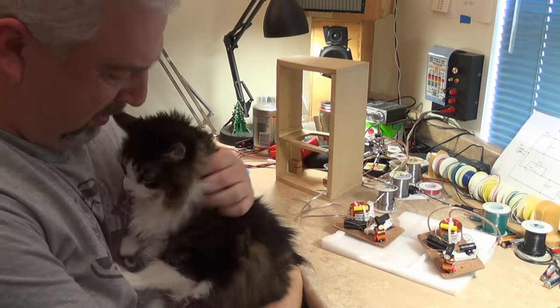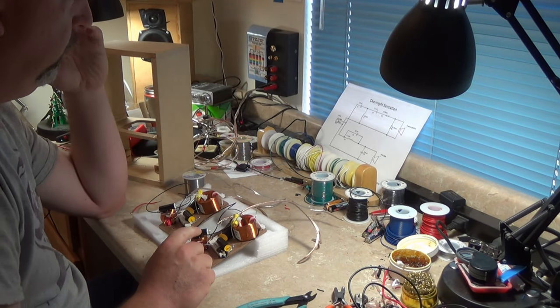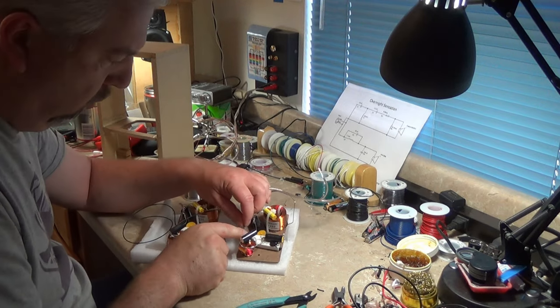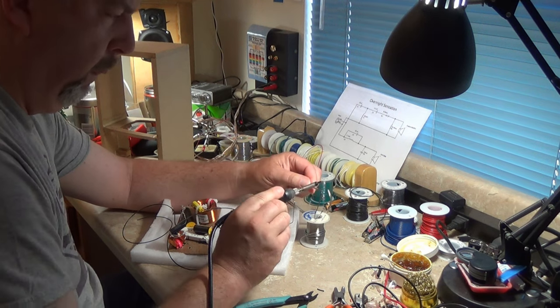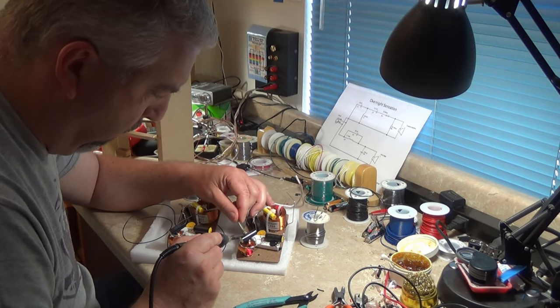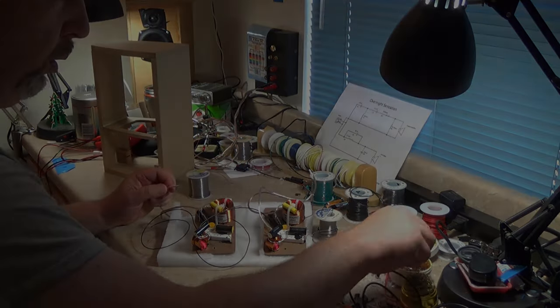My best advice is to go slow and keep checking the schematic to make sure you're on track. Maybe start with the input leads, and then connect the components and wires for the tweeter, and then for the woofer. My point is, it's easy to get confused here. Just keep looking at the schematic and double and triple check what you're doing. It was evening when I started this, for instance, and I had to stop and finish up the next day because my mind was just getting too bogged down with all of this. Sometimes a good night's sleep can do wonders for your brain.